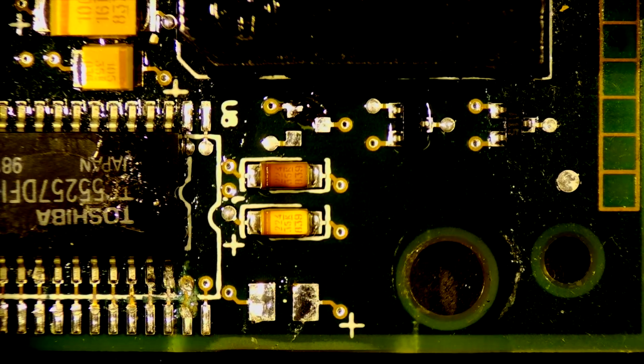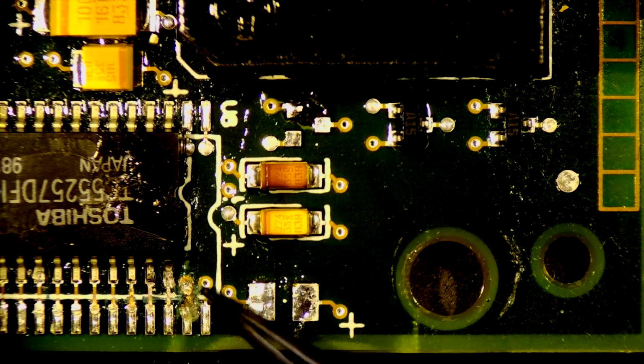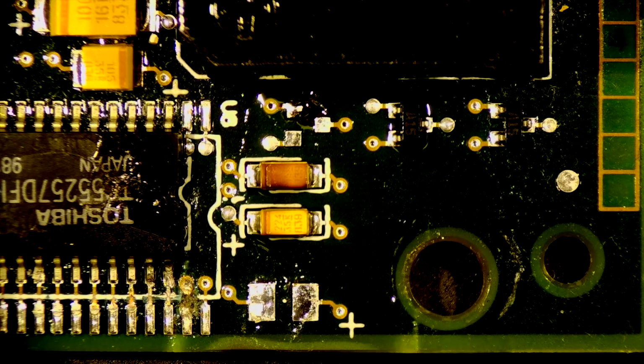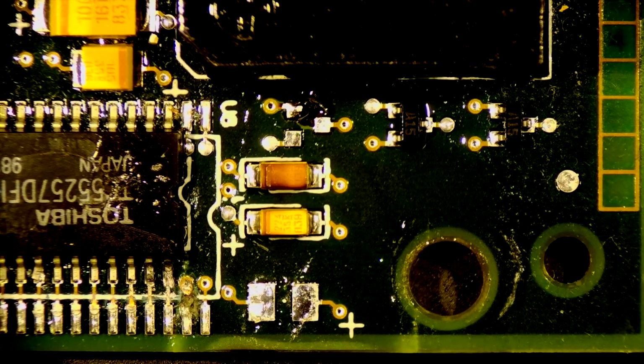What happened down there? I didn't even see that before. We're gonna have to maybe potentially fix this too. I'm not sure if anything plugs into here or if this goes to the other side of the board, but yeah, I'll clean that up and fix that in the event that it is in use. I don't think it is though, because this, you know what, it's not. This is meant for a bigger chip. So in case this chip needed to be a different one, it has those components populated. In this case, they are not in use. So I'm not even going to bother.